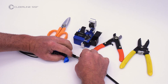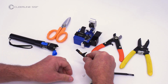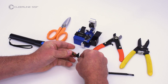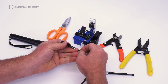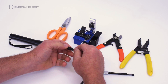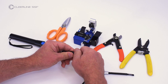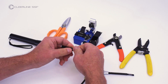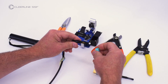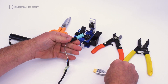Slide the activator tab towards the connector tip. Remove the connector from the VFL and install the dust cap. Slide the buildup tube forward and seat in the rear of the connector. Ensure fiber is straight and close the hinge. Tighten the boot until secure. Install the connector cover. The termination is now complete.